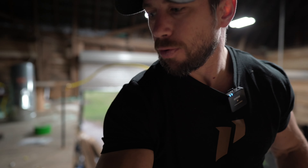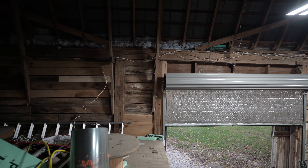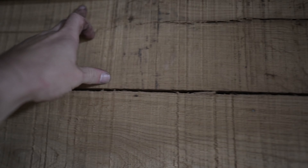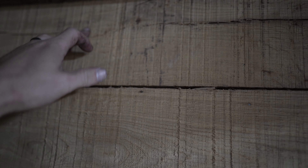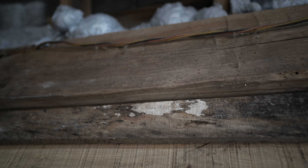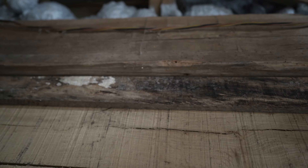We got the wires run across the top of the roll-up door. The big thing next is bringing this cord behind the wall — we're going to have to run this wire down and probably just drill a hole and use a jigsaw to cut out a little notch where the wire can go down. I don't think I've got enough length for a drill bit to get through that big beam there and I really don't want to put a hole in that one, so we're going to run the wire down right here behind the wall and get our outlet right down here somewhere for the top of the loft.